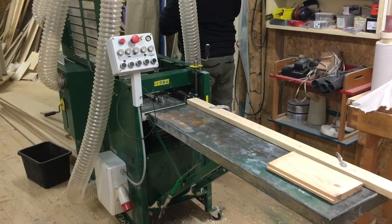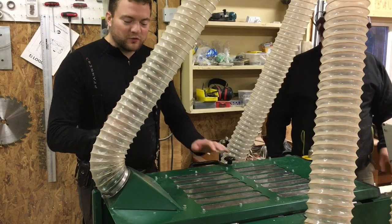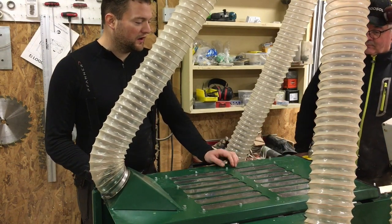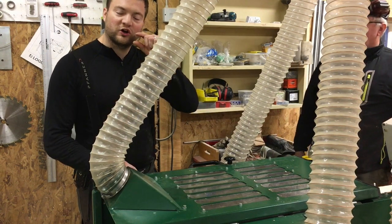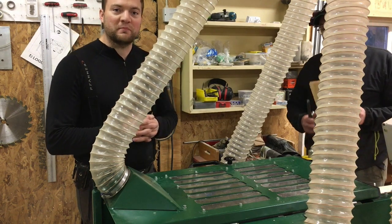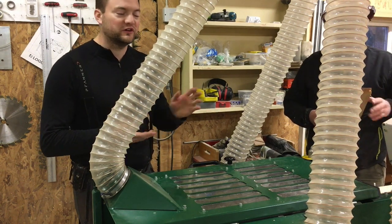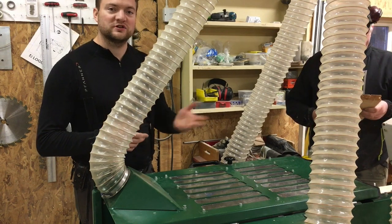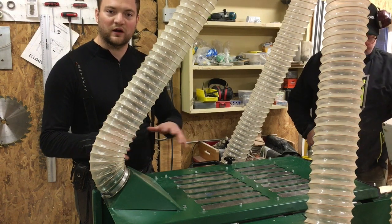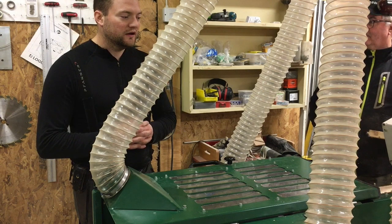What we're going to do now is open this up, adjust the cutters, and plane some boards for flooring. They're going to be 28 millimeters thick. This is lumber that my dad milled for a customer with his Wood-Mizer bandsaw mill about two years ago. He planed a bunch of it for him, and now the customer is short a few boards, but it's very easy to just adjust this machine quickly and plane and mold a few more.